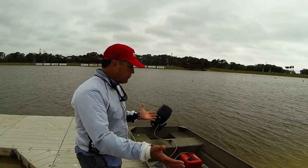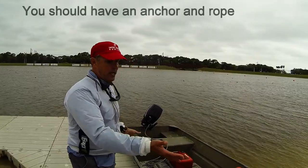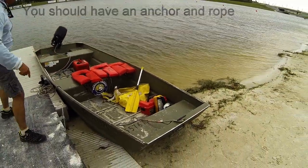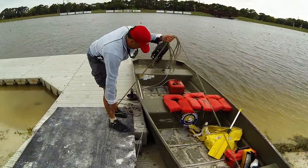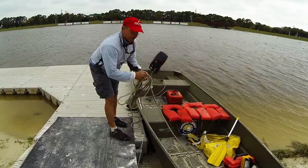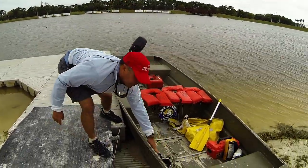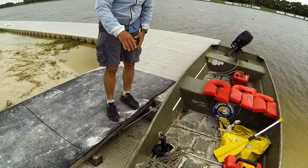This particular boat has all the necessary equipment you need to operate it safely. First thing you see is that it has an anchor. You want to make sure your launch has an anchor before you start out. You can see it's tied off to the cleat. Try to keep the line rolled up neatly — line on the deck can get stuck between your feet or legs, causing someone to fall in or trip inside the boat, making the ride very unsafe. Keep your anchor up towards the front of the boat; it'll help keep the front down on the water.